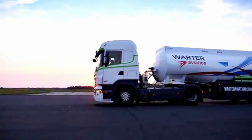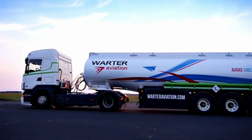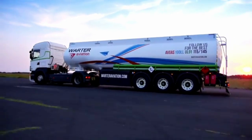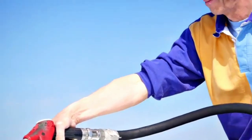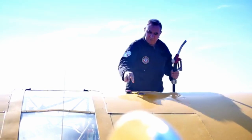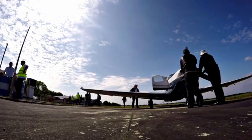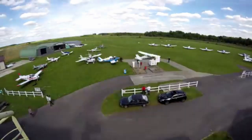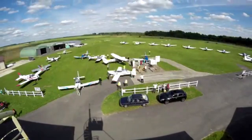The devil is in the detail and it can get complex — hence the reading material links in the description. But in the UK, the use of MoGas in a gyroplane is limited to the following conditions: only if the engine is specifically approved for MoGas; fuel should be fresh, clean, and water-free, not exceeding 5% alcohol content; you must verify full take-off power prior to committing to take-off; the fuel tank temperature must not exceed 20 degrees centigrade; and you should fly below 6,000 feet.